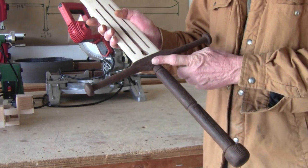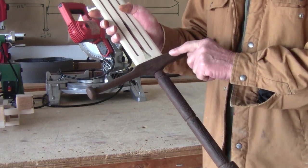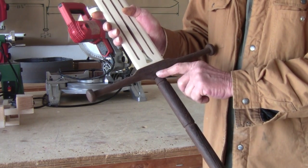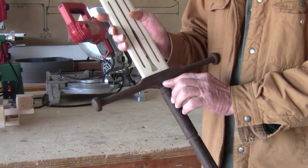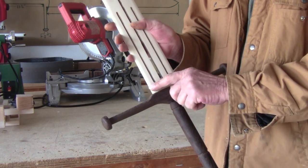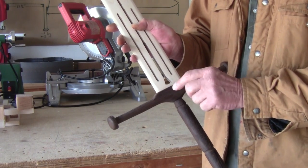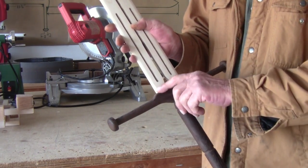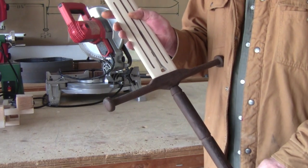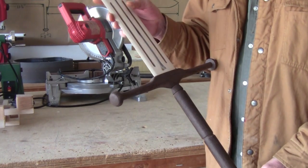What I did was go and cut off both ends of the handle itself, then put it in the cross member and glued it and let it sit overnight to harden up. The second step is the blade itself — I shaped the inside part that slides in to fit in real good, square and level. This has already been glued in too, so the whole setup has been set over 24 hours and it's ready to go.